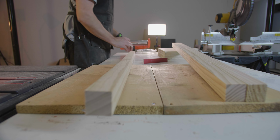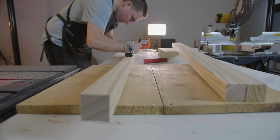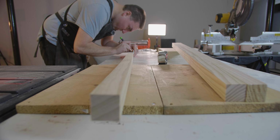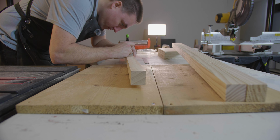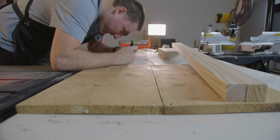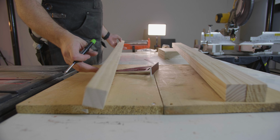Then, using a tape measure and my carpentry square, I carefully began to measure out the locations for my dado cuts. When I was designing this shelf, my wife and I decided that 12 inches between each board was a suitable distance for objects to be within them. However, because the boards themselves have a ½ inch of material, the effective distance between them is 11.5 inches.